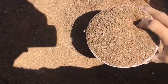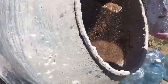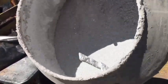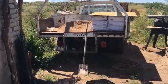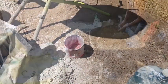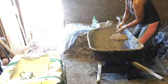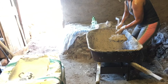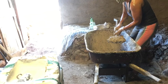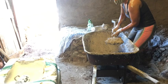The cement mixer works well with the render coat. The sand I use is wash sand, which has little chunks of aggregate in it — a chunkier mix, not fine sand — and this is for the render coat, basically a scratch coat. The ratios we went with were three parts sand, 1.25 parts lime — some people go with one part lime but we went with 1.25 — and two parts water, though the water amount depended on how damp the sand was.